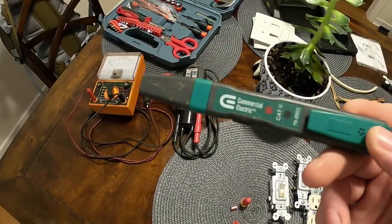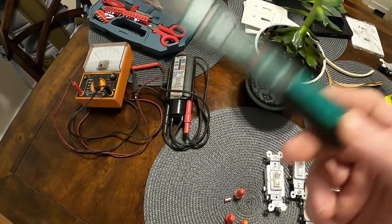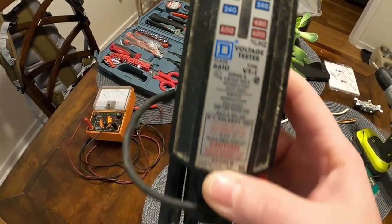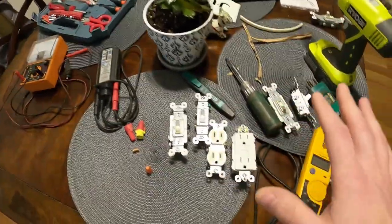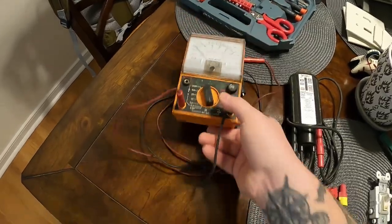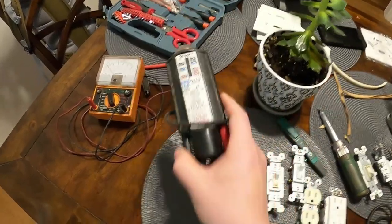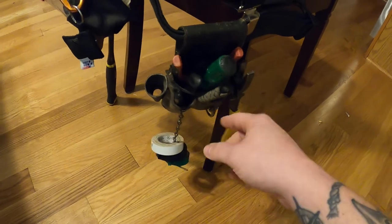People actually use these hot sticks for ghost hunting — they say it'll set off when there's a static electricity charge like a ghost nearby. Whatever. I don't recommend these unless you're ghost hunting, I guess. These older ones are called Wiggies. They're not battery-powered testers, but they are some of the best you can get — you will not get false readings like you will with some battery-powered ones, which can actually read the battery voltage and give you a phantom reading. If you can spring for the digital meter, go for it, but if you can find a set of Wiggies, get them. At the very least: tester, screwdriver, pliers, strippers, a knife, and some tape.